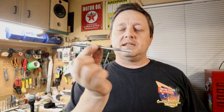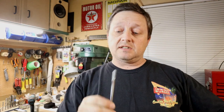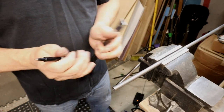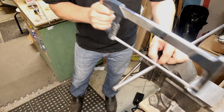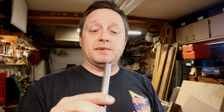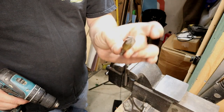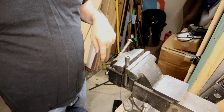The second part is now that the rod is done, we need to cut the actual barrel for it. We're going to cut a section off — since this is six inches, if we cut it down to five and a half inches that should give us a lot of room to work with. We'll mark five and a half inches and cut it with the hacksaw. Now that we've cut it down, we're going to make both ends perfectly 90 degrees and nice and smooth using a standard mill bastard file in the vise, eyeballing it as square as we can. We can also use a chamfer tool in the drill to take the burr off on the inside — that's pretty handy.